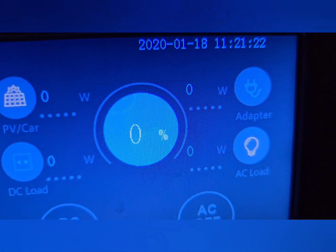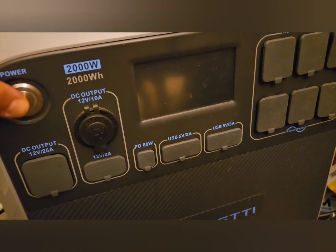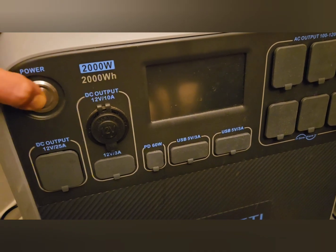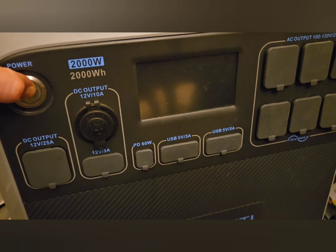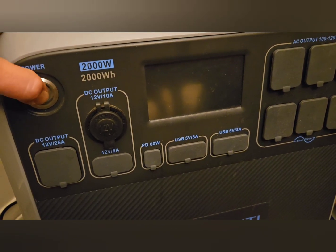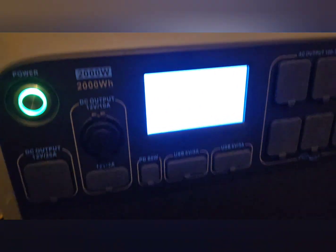But anyway, that's how you fix the Bluetti. You keep her plugged in for, some people say 12 hours, I say go for 24. And just clear the faults right away, and then don't touch the screen. You will notice, like in my video here, it was getting a partial charge. It was a real low one, but I believe it was starting up, because it was getting about 91 watts in. And now she's running well over 439, around 439 watts in currently.